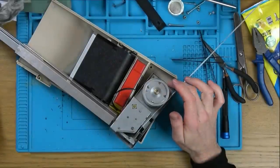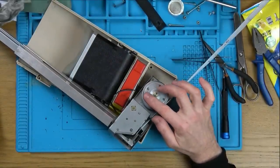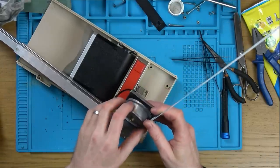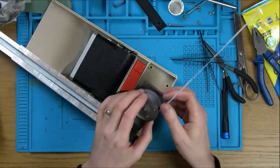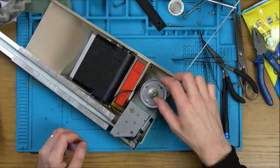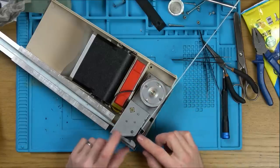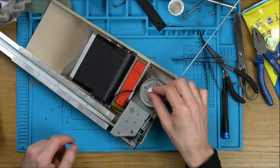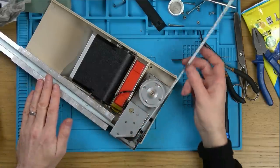Let's think about this. I'm sure when you have a retractable tape, the spring is in here. Yep. And if you have a look, it definitely looks like there's something in here. And also this mounting here, the mounting holes look a bit weird as well. I'm wondering if there should be a spring in here which has come loose, because I'm thinking that this should always be under tension and then the motor pulls the periscope out, but then this wants to bring it back in. And because this is spring loaded, because it's been wound by the very fact that the motor's pulled it out, it wants to reel this in.